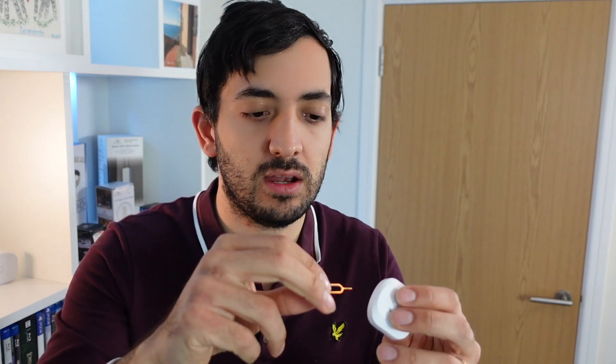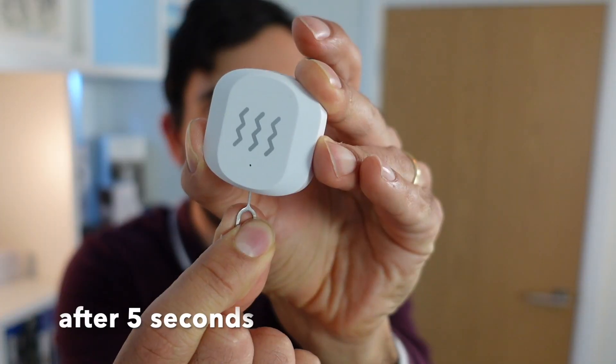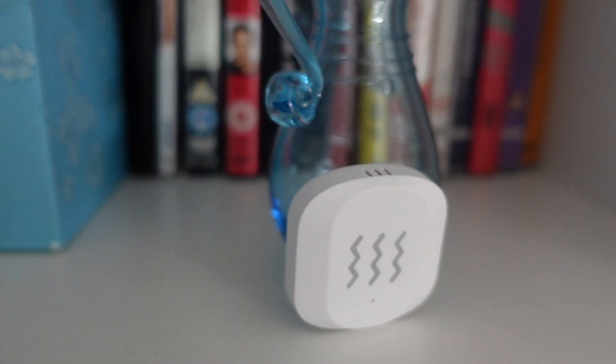Let's look at one of these vibration sensors. In the box you should have one of these little pins — these are quite common and you can just get any pin. You'll see there's a button right there. Just press it in, tap it in, and then you'll see a flashing light. Once you see that flashing light, you know you're good to go. Get the app back up and tap on 'LED already blinking.' It will then go into search mode and scan for the device. You can try adding maybe a couple at a time. Just bear in mind that if you reset it twice, it will just change the name slightly and add a two on it, but you can go back in the app and rename the device to whatever you want.